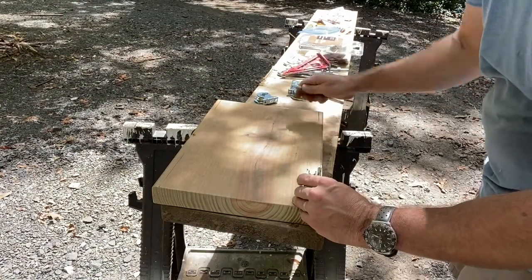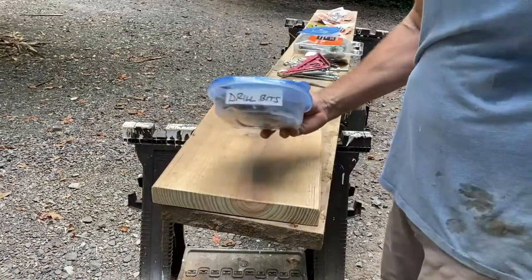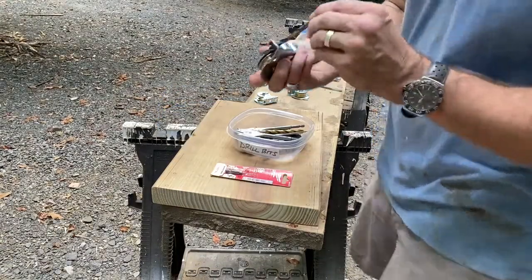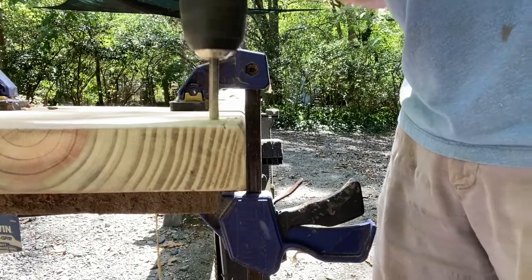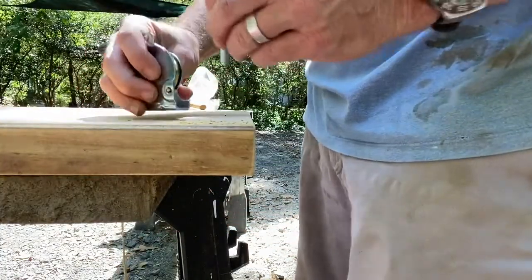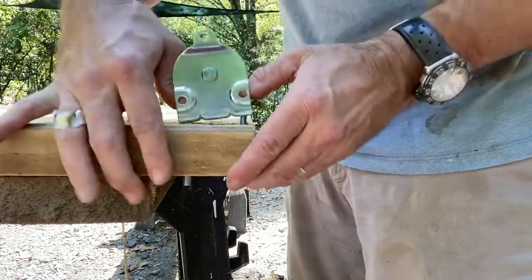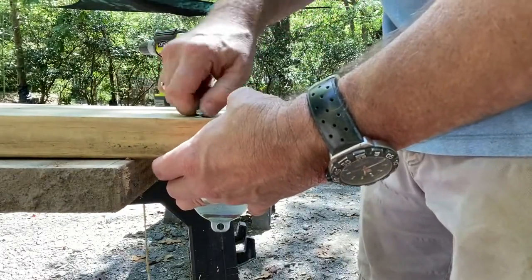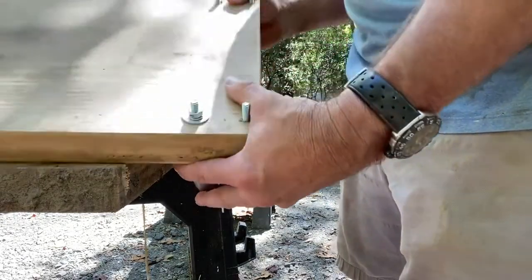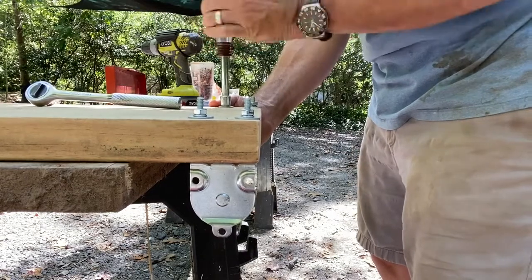I put the pulleys on that line and then marked circles inside the hardware itself for where I need to drill the holes to insert the pulley through the trolley. Then I found a drill bit that fit the pulley hardware perfectly and drilled through the trolley. I got the hardware that came with the pulleys, inserted it into the pulley assembly, inserted that entire thing into the trolley, and then used the washers and nuts to tighten everything up with a nut wrench — though a socket wrench would work too.